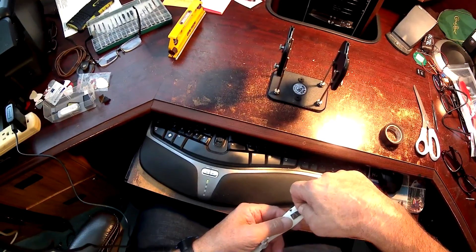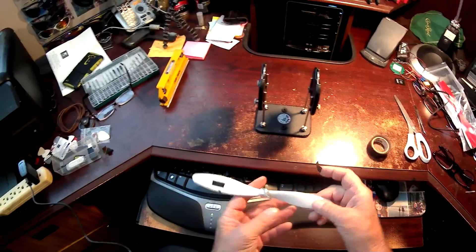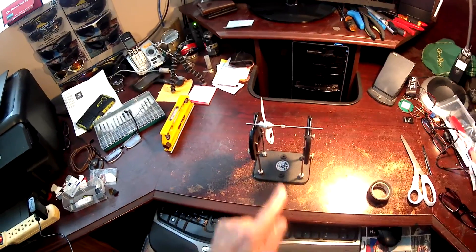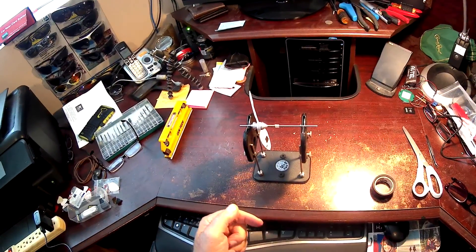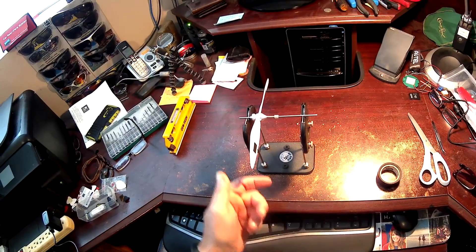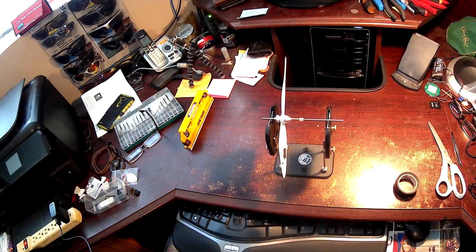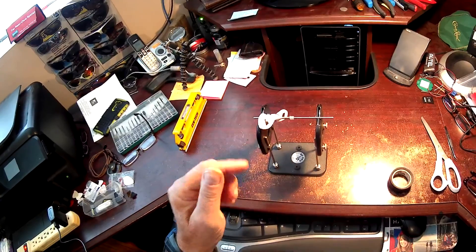Let's put one piece of tape here — you're just arbitrarily trying to get an equal amount on both sides from the hub. Let's put it in the middle on both sides. Now let's check it again. It shows that it's heavy on that end, which means that piece of tape is too far toward the tip, or the other side is not far enough. Now this side shows it's not too far off horizontal balance, so let's work on the vertical first since the horizontal doesn't look too bad.